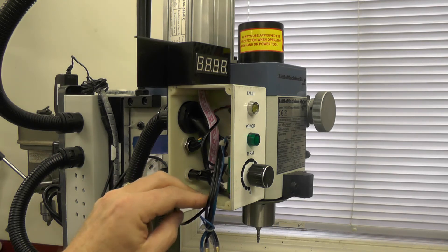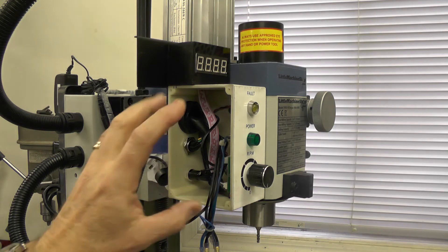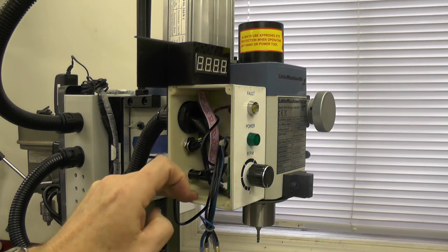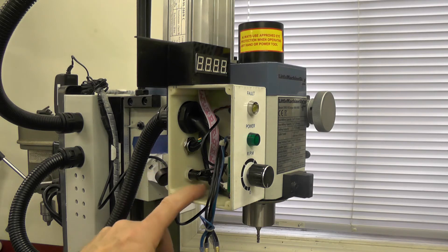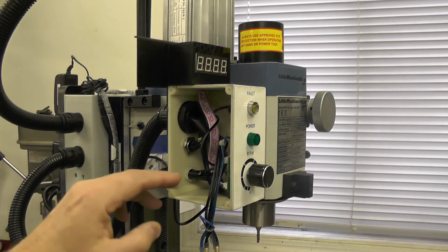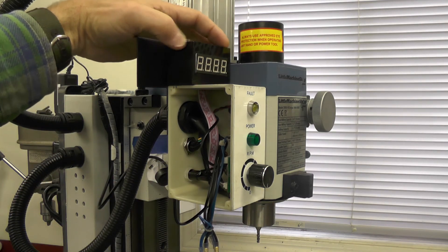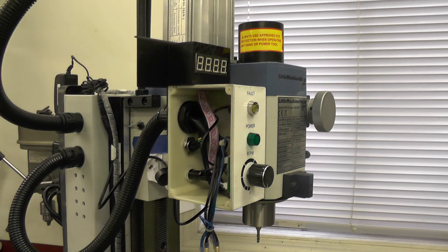There were two criteria I was really pursuing when I decided how to mount this. One is I wanted to minimize modifications to the control box — I wasn't really interested in cutting a hole and mounting the tachometer board into the faceplate, which some people do and it looks very nice. I just didn't want to modify it any more than necessary, and I wanted to make it removable, which it is. The only real modification to the mill itself is cutting the slot and feeding the ribbon cable through. Other than that, this is completely removable — I could just unplug it, remove the plastic connector, pull the cable out, seal that slot back up, and be back at stock.